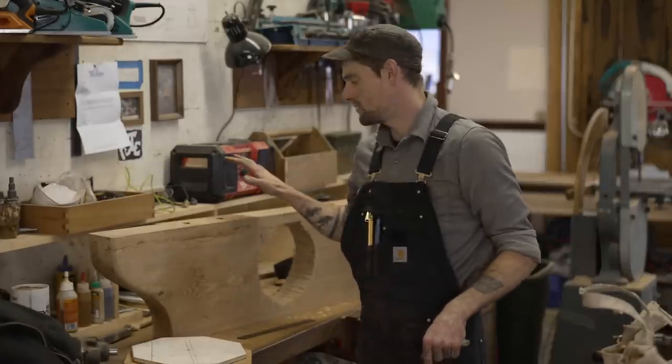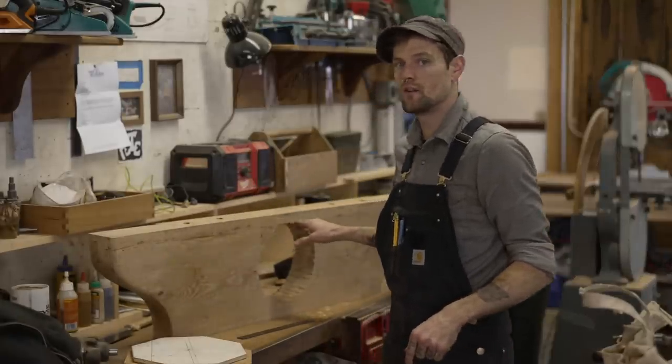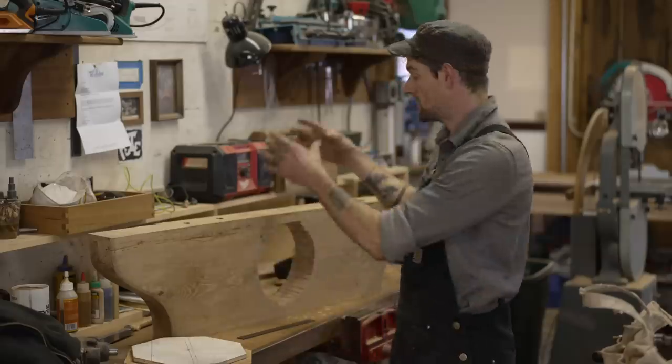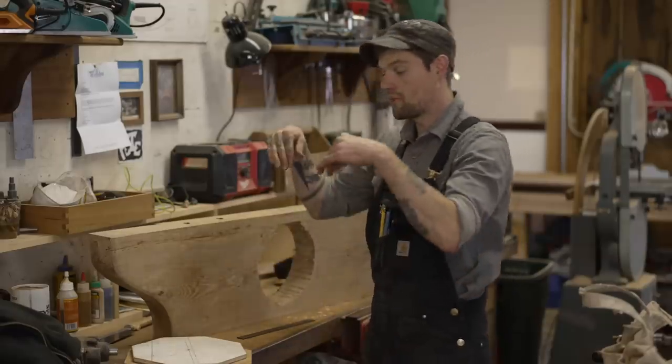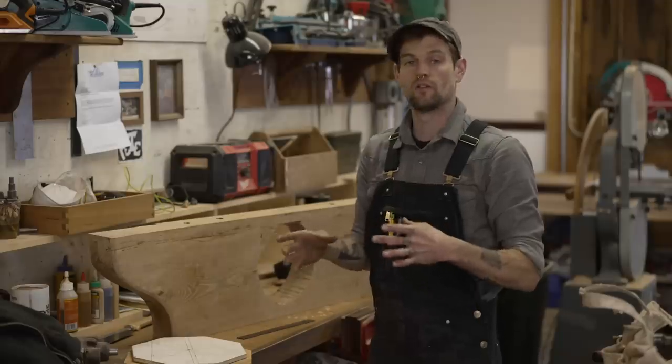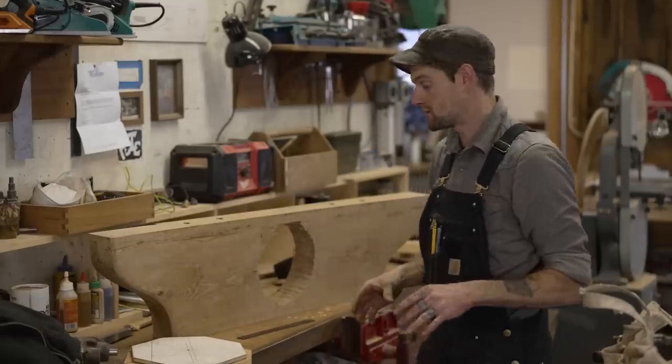So the mast gets wedged in our mast partner here. So this is let into deck beams. The mast goes through it. From the top, we're gonna make 8 wedges that push tight against the mast and that holds it steady in the through the deck penetration.